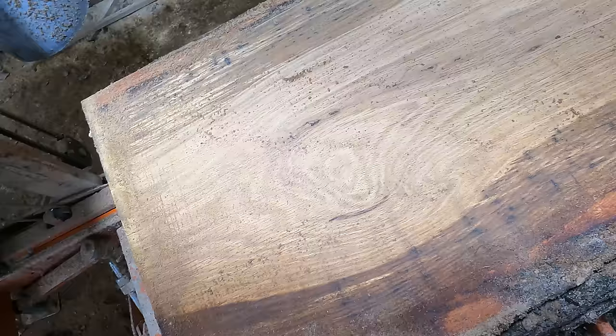All right, I gotta roll it up. Square. Mm-hmm. Couldn't get any better than that. Yep. Okay. That's as square as she gets. So maybe it's an illusion because this part's farther forward that it looked higher. The bottom's a little off. Hmm. This is perfect here. The bottom's a little bit off. So I need to take a shim off the bottom, which means I gotta roll it two times.